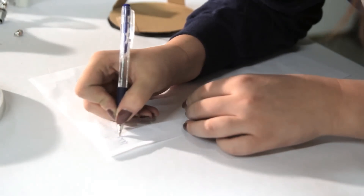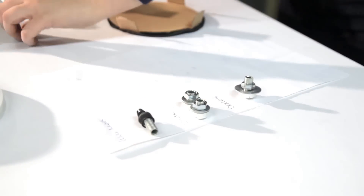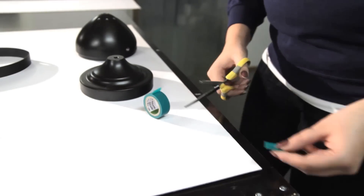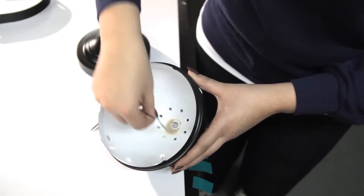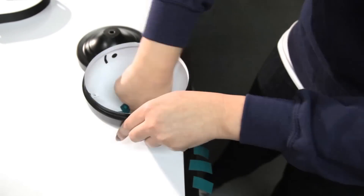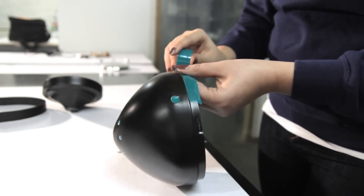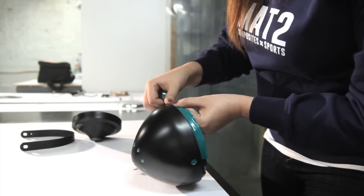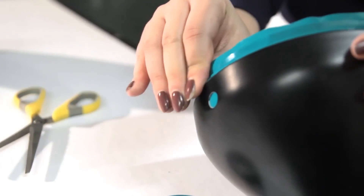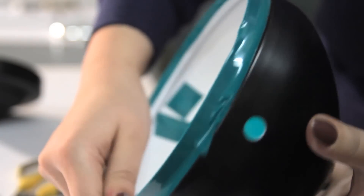It's just some hand labor and some basic materials. Keep in mind that the carbon fiber and epoxy resin will add some extra weight, so you won't get lighter parts, but you will get slightly stiffer parts and you get the good looks of carbon fiber. So that's what we are doing it for. Here my girlfriend is taping off the edges of the lamp just to prevent epoxy resin going in or sticking to the part. The green tape is self-releasing from epoxy resin, so this is why I'm using it.